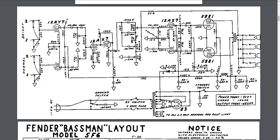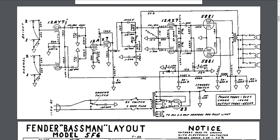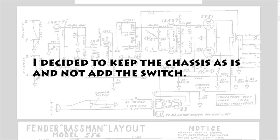And then that goes into the tone stack here, which has a treble, bass, and a mid, and there's also a presence that comes back from the negative feedback. So if you look here, it starts off of the output transformer on the secondary side by the speakers. They bring that in for negative feedback into the circuit, but they also have a presence control with that as well, right here. This is one of the mods some people will do, and I'll debate it, I don't know, is they will actually put a little switch somewhere about here to take that completely out, or they'll put a potentiometer in that allows them to dial it down to near zero instead of using the presence itself, which is only 5K. Which is just kind of a subtle tweak. But at any rate, negative feedback does do some good things, but also it takes a little bit of the edge off of the amp, so we'll see. I might add a switch to just disable that.